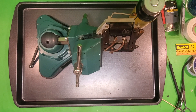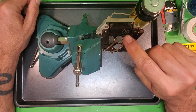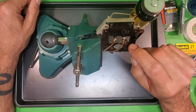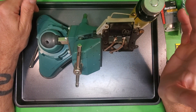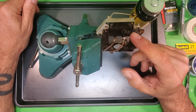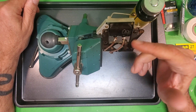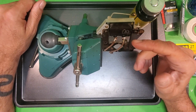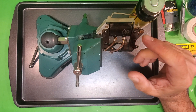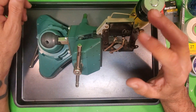Now we're going to talk about the coil. This is the coil right here and it is usually very, very fragile. This one happens to be in extraordinarily good shape, but it's a bunch of thin wires wrapped around this piece of metal, held in place by paper — and this paper deteriorates over time. It starts to fall apart, so yours might not be in good shape.